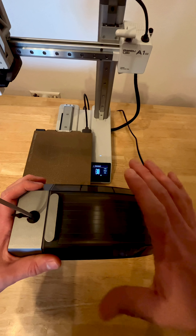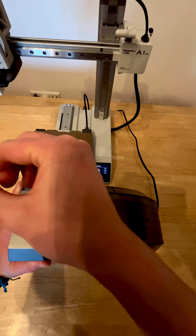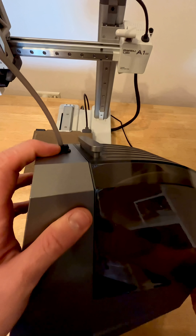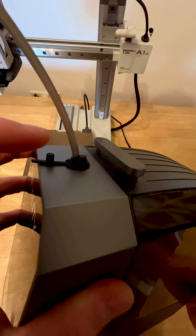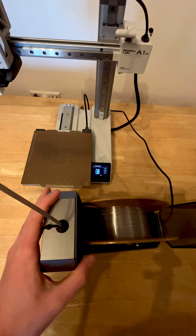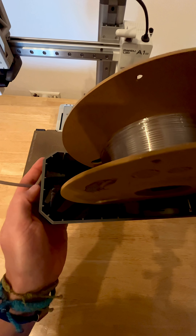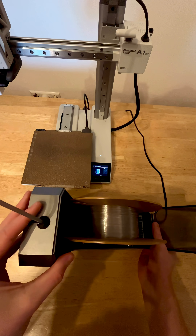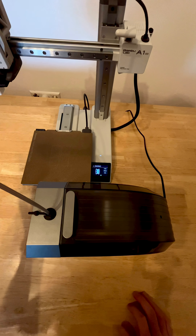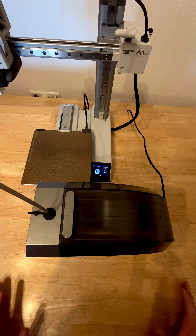It's a very easy fix — when unloading and loading filament, this tube still has got a little bit of movement if you don't fasten it somehow. I grabbed some cable ties and added one at the top above this rubber buffing, and also inside I put through the line and added one at the bottom. Through that you actually prevent the tube from getting pushed out when loading or unloading filament, and that's the way to go.